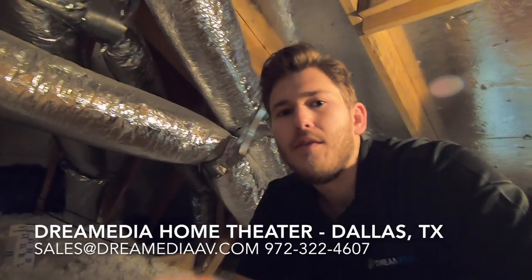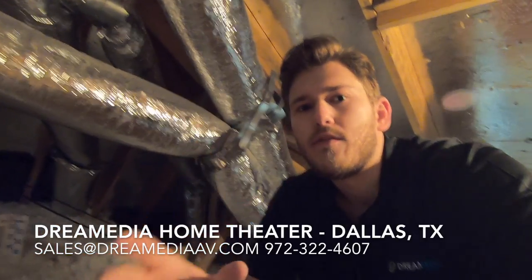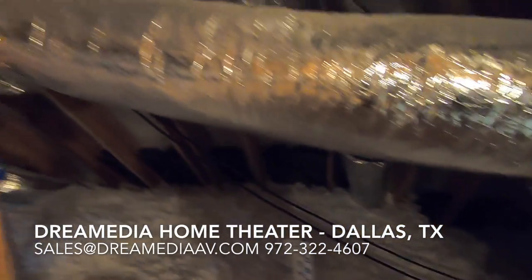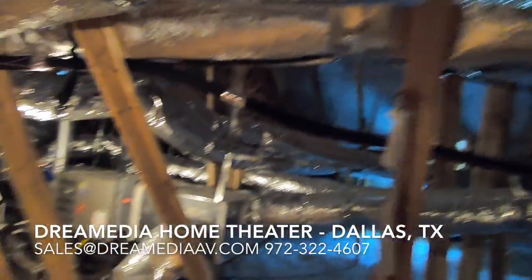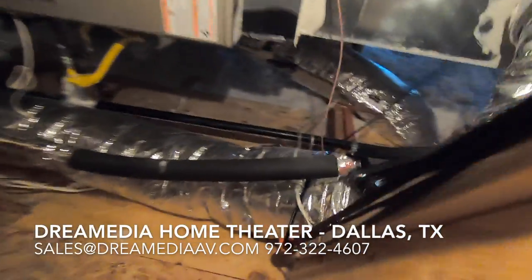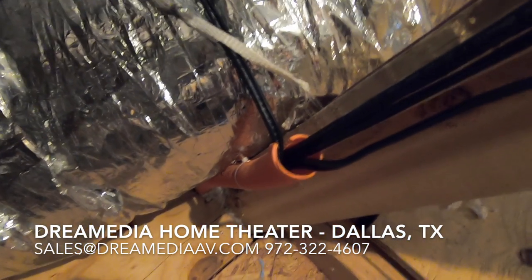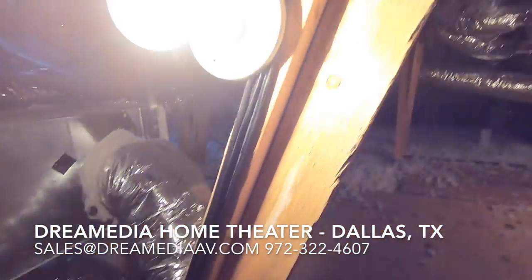All right, so this is the next step in getting the wiring to our final location. The wiring is gonna be fished, or actually already has been fished since we're kind of in a time crunch here, but I wanna catch you guys up. See these lines right here? These are our RG59 with power, which we did fish up and out of the walkway over the top here, and then down into a smurf tube. And smurf tube is just conduit that helps running lines a little bit easier. We ran these lines straight down to the master closet, which I'll show you next.